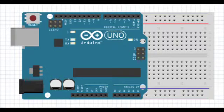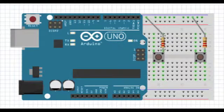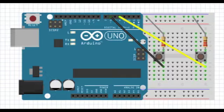The next part of the project was to wire everything all together so it works in a symphony of harmony. I first placed 2 buttons onto the breadboard, one at the very bottom in the middle of the breadboard and another 4 rows above that. I then connected resistors to each of the pins next to them and the other side to the ground. Also, on the other side of the buttons, I placed a wire next to each in line with the resistor. I plugged these wires into pins 4 and 6 on the header.